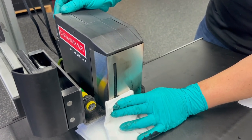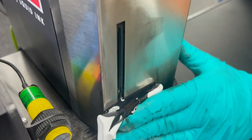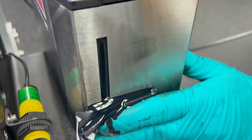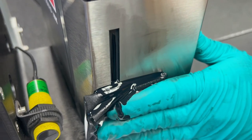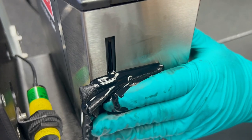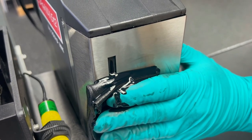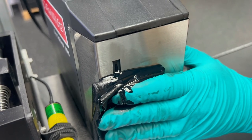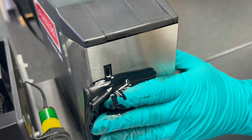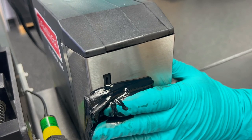As you can see on the print engine, it's going to slowly go from the bottom all the way to the top, expelling all that ink. What I'm looking for is a nice smooth run of ink with no air bubbles. To make sure that's happening, I'm going to go slowly up the print engine as I'm pushing down on the purge button to help force out any bubbles that could be stuck in the engine itself. Once you're satisfied, you can go ahead and release. Keep your lint-free wipe in place because more ink will come.